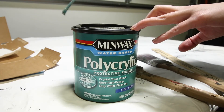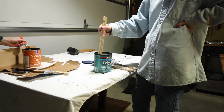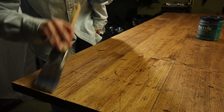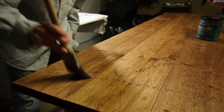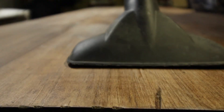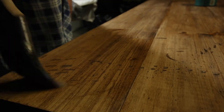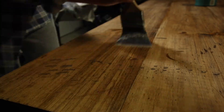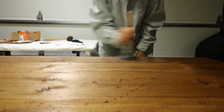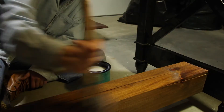After the coat of stain, it was time to poly. Poly takes at least three coats and you have to sand between each one, so this definitely took the longest, but it's worth it. The process: take a paintbrush, poly the whole table, let it dry, sand it down, vacuum up all the sawdust, wipe it down with a tack cloth to make sure you got all the sawdust, then poly again. You keep doing that until you're done and you're left with a final coat of poly that gives a really nice smooth surface. Since the table is going to be used a lot, you need that poly coat or else dust is going to stick to it. You just need that top coat and that's it for the table.